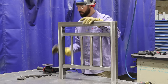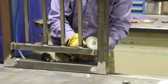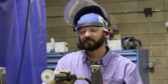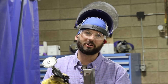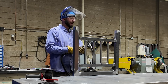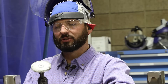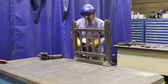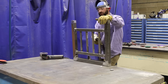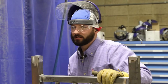Getting on the inside here to clean up some of those welds, this angle grinder is obviously not the right tool for it — this bristle brush will get into those spots. The big thing with this type of grinder is you've got metal all around your spinning bits, and those metal bits are spinning just as fast, and you don't want to rub those spinning bits on your part. This thing can get away from you a little bit easier than an angle grinder especially when you're working in corners, so be aware of that — have a good grip and have all the safety gear intact. I used these bristles mostly when working on stainless steels where materials definitely couldn't get cross-contaminated, and these bristle brushes were always a safer alternative to clean up a weld.